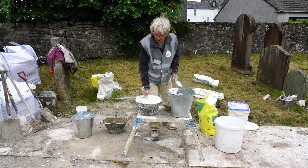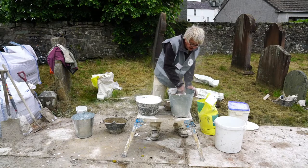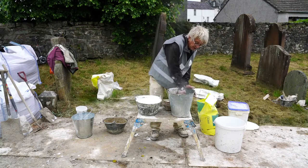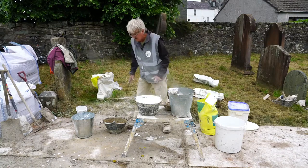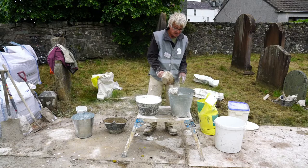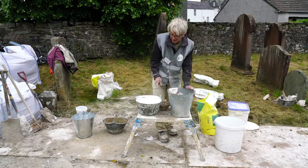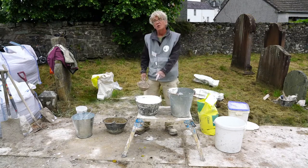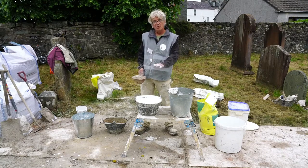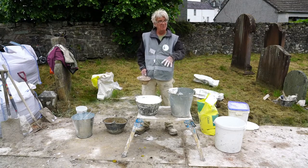But alternatively, now that the slake is finished, there it is, and this one too, you can see in here I've got a paste. So I'm now, and I could have done it a bit sooner, going to add more water into there, obviously. Again, adding the extra water when the slake is complete, and start to stir that around. And equally, although I could apply that now at that thickness when it's hot, I'm going to add a bit of water to that just to thin it back again. So I could have used it before that final thing, but I wasn't. But again, we want this minimum temperature. That's where the secret lies. That's where the magic comes from, the temperature.